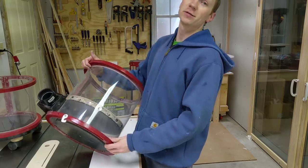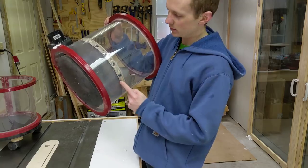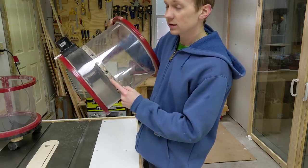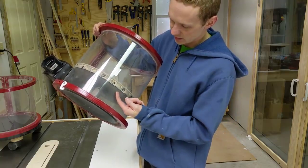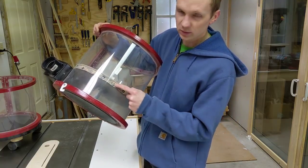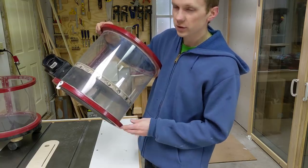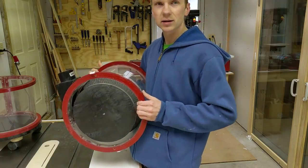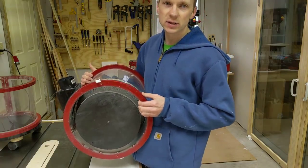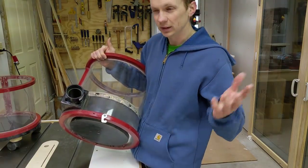One of the most frequent comments in the original video is how I forgot to put silicone on the bottom of the divider on the inside of the cyclone. Because I forgot to do that, all the dust has a tendency to collect in between the polycarbonate and the inside ring, and it doesn't really look the best. The function is okay, but I can't really add it now either because the cyclone separator plate is blocking me from getting inside. So let them learn.